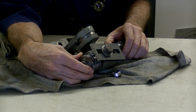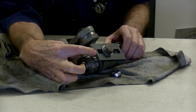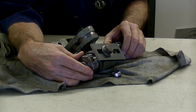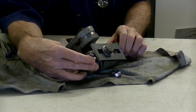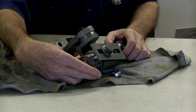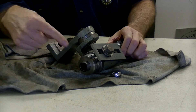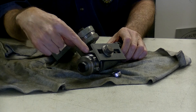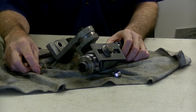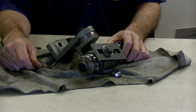So going through this again: the screw head touches the cam plate and as you rotate the shaft of the tool and cutter grinder it rides up the cam, gets more distance back from the grinding wheel, and drops off into the next flute. This is for a single flute tool. If you've got a two-flute tool like a drill, you will have two screws; for a three-flute, three screws; for four-flute, four. You can have three and six here, one, two and four here — just take the screws out and fit them in the other positions. Not a lot of genius involved — just following commercial designs the way they've done it.